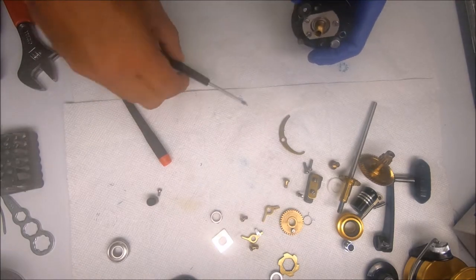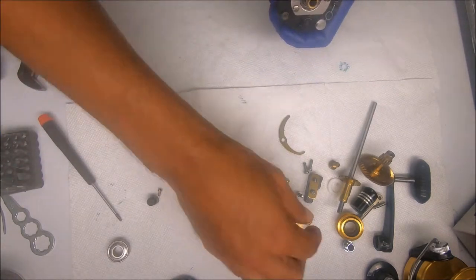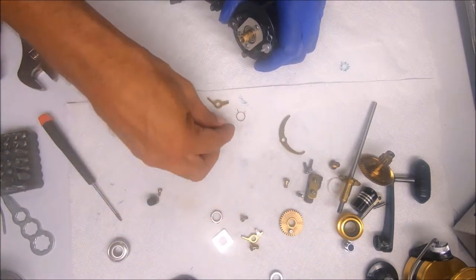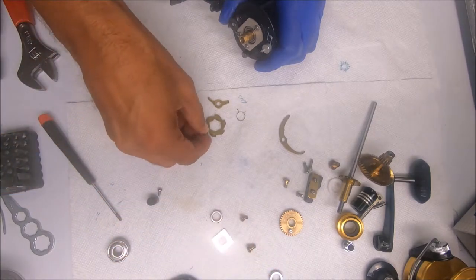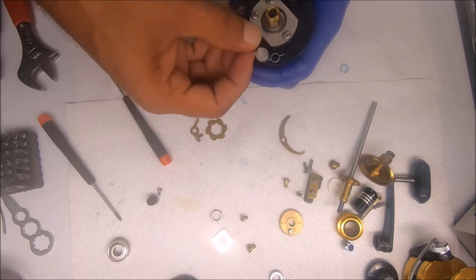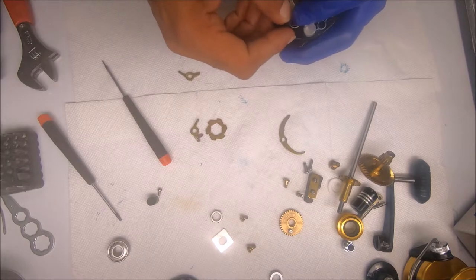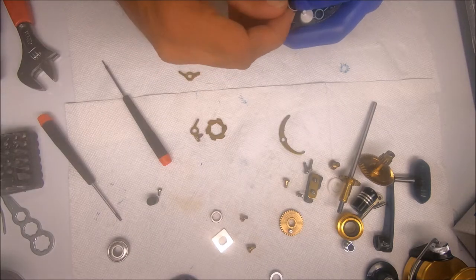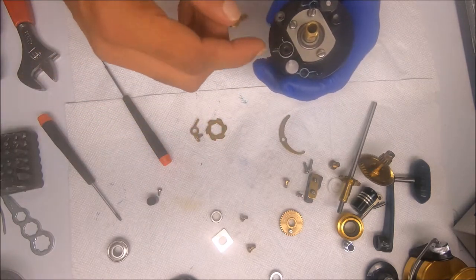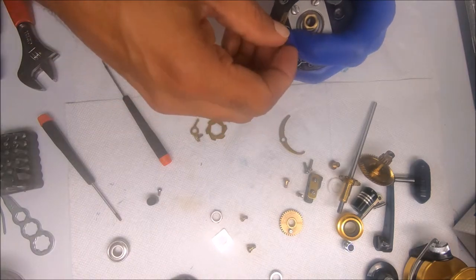For the dogs, I like to start with this dog on the side that comes with the spring, before attaching the ratchet and the silent dog. I'll set this in place — the spring in place — and this is the position it needs to be in to work properly. But when I go to install it, I open it up so it's free and it would not work, and then I put the dog on top of it.